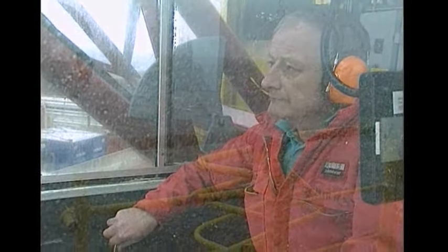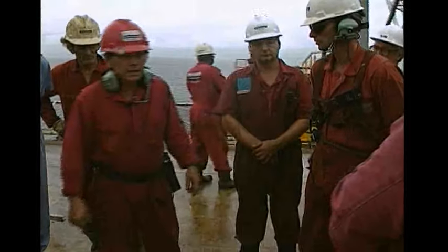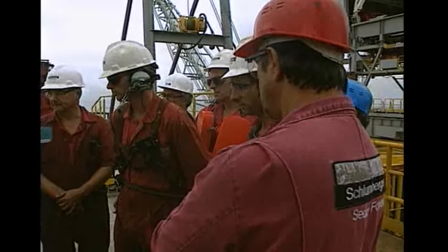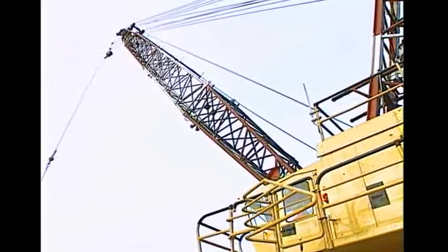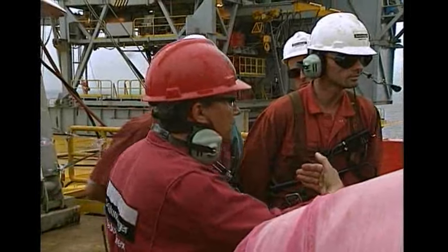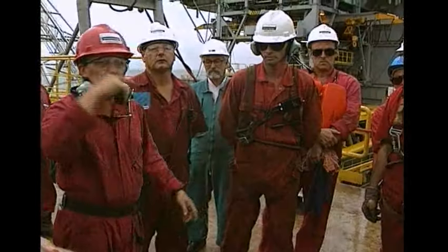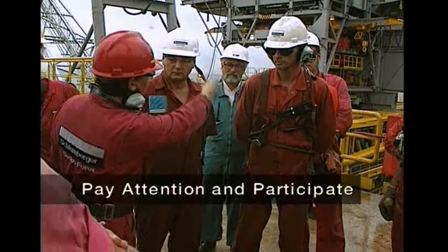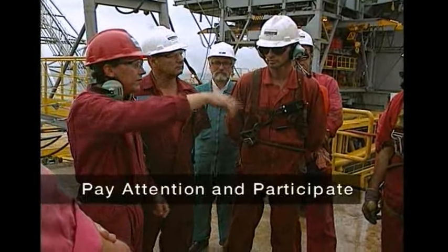Another essential part of your day will be the pre-job meeting. This is where you'll find out everything you need to know about the job in hand. Your supervisor will give you vital information including the types of loads that will be involved and the conditions you're going to be working in, such as the weather or if there'll be any helicopter activity. It's also important that you know what other work is going on around you — for example, who's been delegated the job of signalman. At the pre-job meeting always pay attention, participate, ask questions to ensure you fully understand the requirements of the job, and provide information to your fellow crew members.